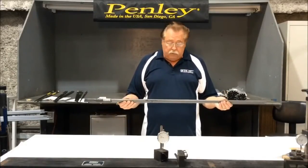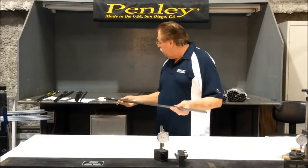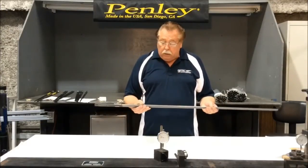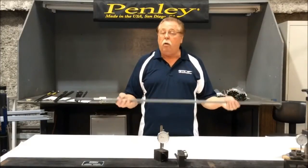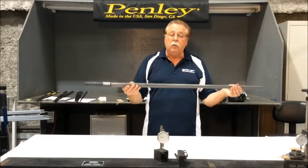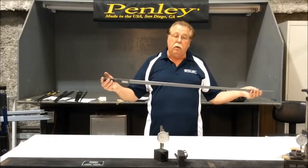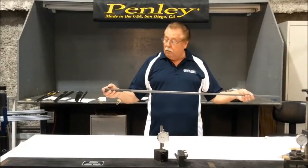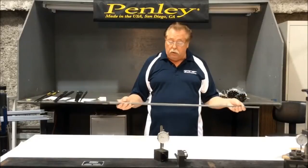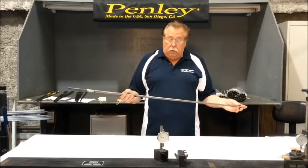These are made offshore, and they were made at the wrong flex. I believe these here were supposed to be S flexes, and they're private label. The flexes really are off. So right away, these guys who build these clubs every day and use my shafts, this private label company, knew something was wrong right away. They contacted me again. Wrong butt diameter here. So we have a problem there. We have the wrong diameter on the grip end. So that's wrong. Of course, none of the three are in spec.